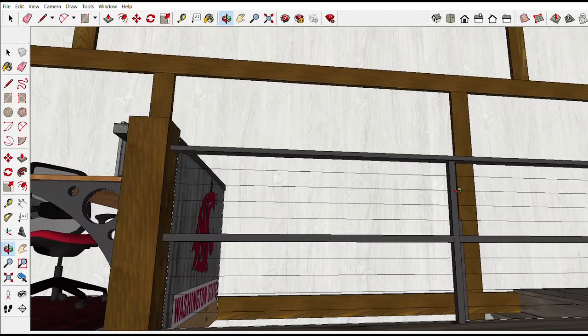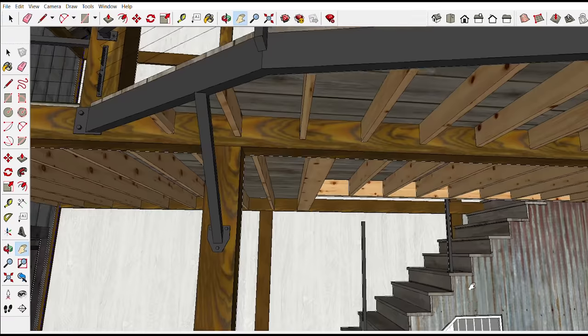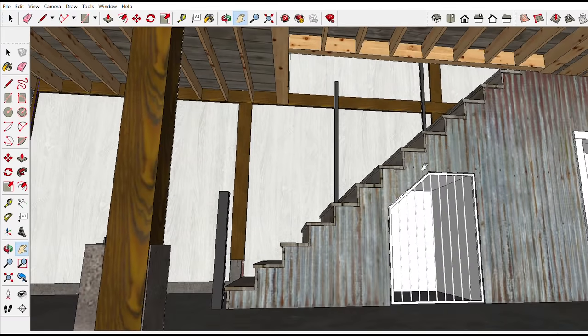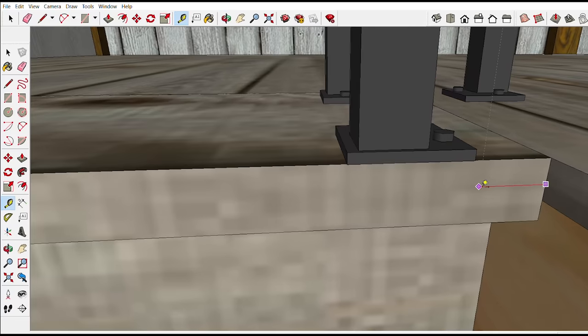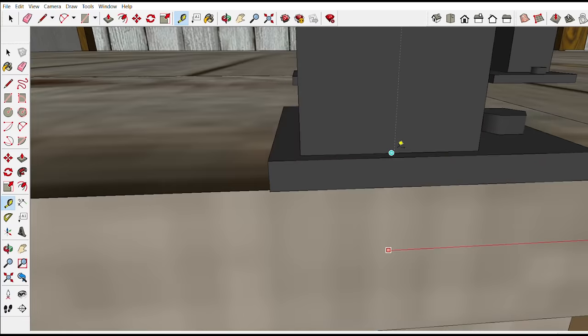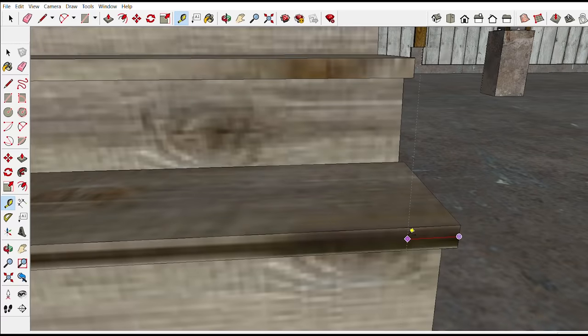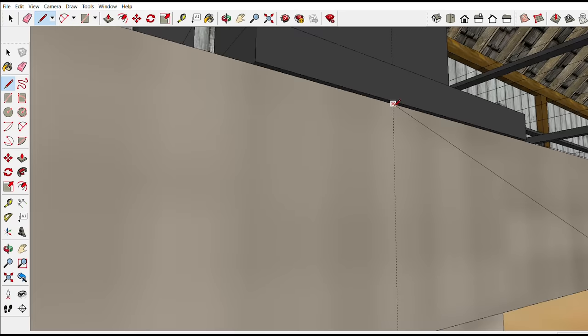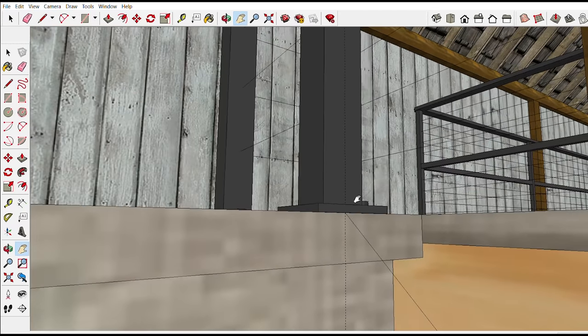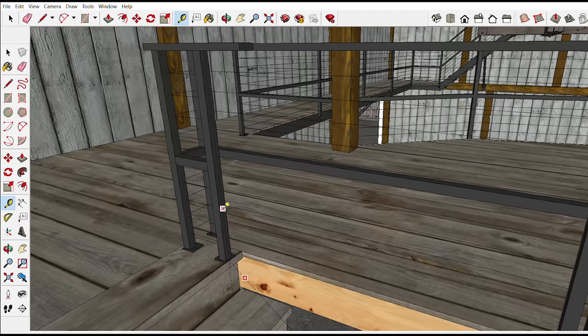I'm not positive that this is the correct way to design a railing. I did a lot of research, but I could still pretty easily be wrong. It seemed like the point at which the handrail starts angling downward should be lined up with the face of the top stair. In my mind, this made sense because your hand will sort of naturally reach out and feel that point on the railing, and then the rest of your body will know where the edge of the stairs start. But take this all with a grain of salt.